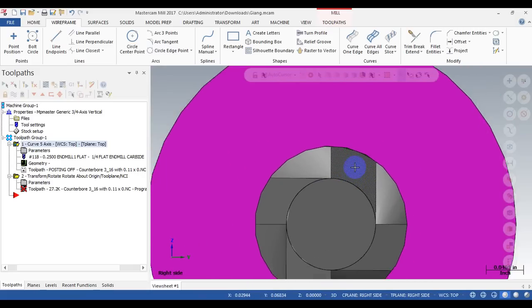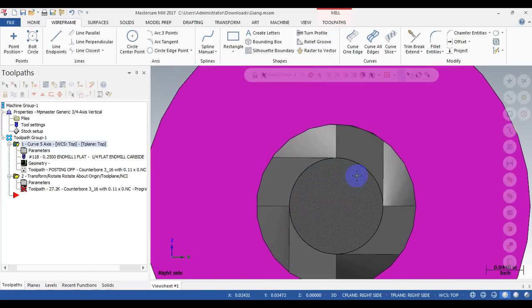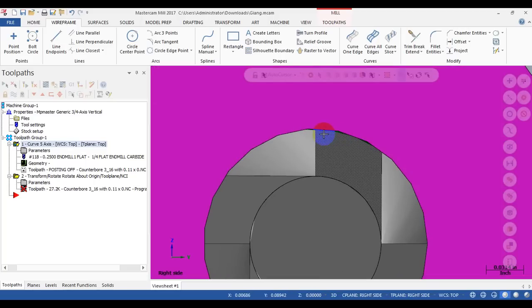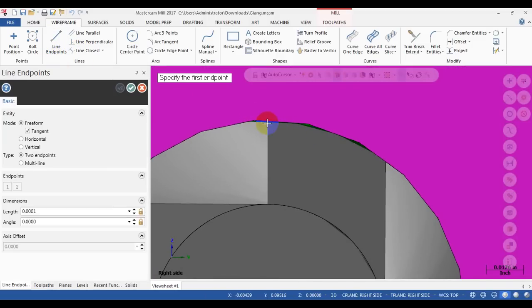Let's take a look from the front. For example, this is the part and this hole we want to counterbore. If we don't cut the relief angle, the tool will make full contact with the hole surface. This is rubbing into the material and it makes the tool wear quickly — you don't want that. You will also get a very bad surface finish because you have no cutting motion, just rubbing.